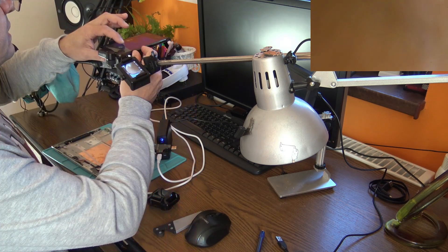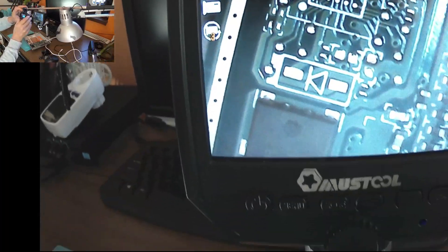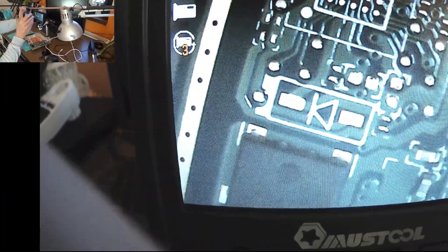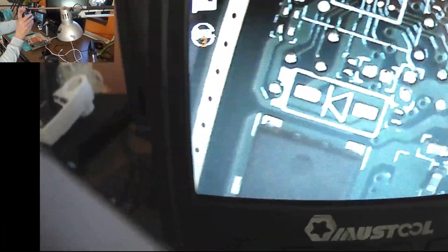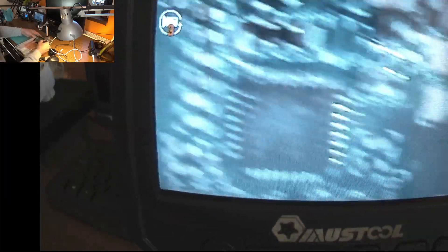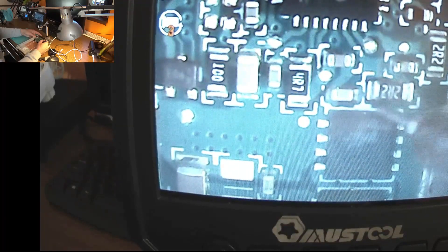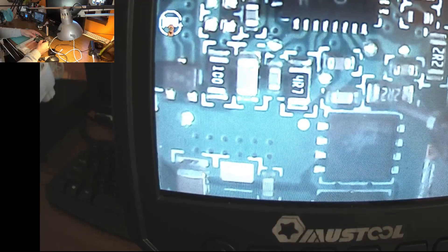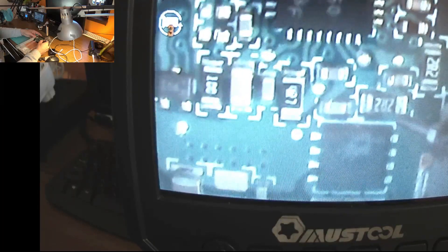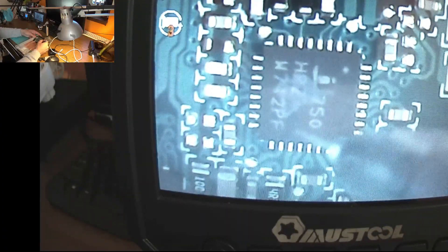We can close the camera and take a look under the microscope. Let's identify those parts. I'm lazy to connect the microscope to the computer, so we have to do it like this. Let's try a kind of anti-glare light. So, what I found so far — it was something here. That's a resistor, getting hot, 2.2 ohms I think. And next to it is this circuit. You can see the pencil mark clearly.